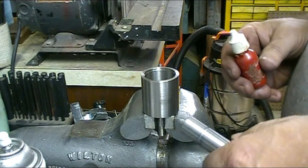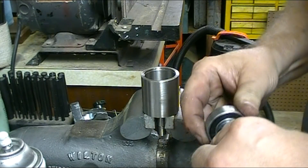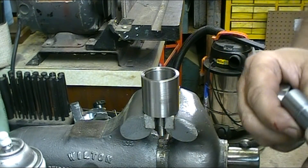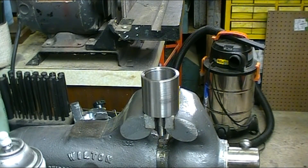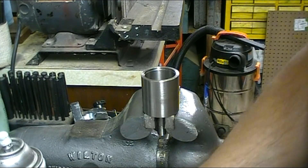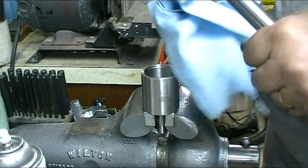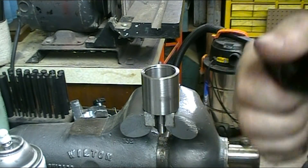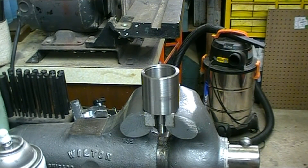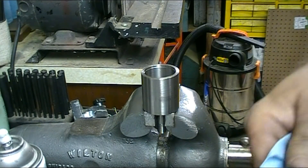And here comes the final assembly. I need to slide this bearing on here first — I had a little bit of a burr there that I've got to take off. After cutting the snap ring groove, there was a small burr that kept the bearing from sliding on. I just take and clean all the oil off of here because I'm going to set everything in green Loctite.